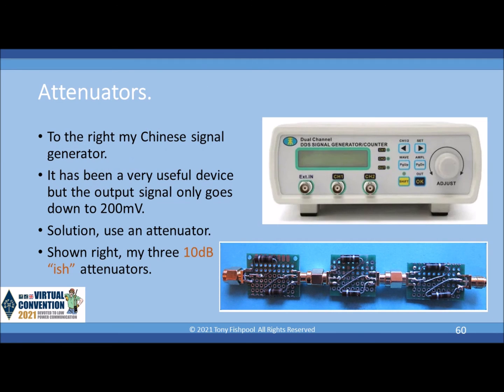So a note about digital signal generators. A few years ago a good friend had recently bought one for himself, and as he's done before, he put temptation my way by letting me play with it. The user interface was a bit odd. They've got a lot better recently, but it produces two unique outputs at any frequency up to 25 MHz, and sine and square and triangular waves, and at any phase difference from each other. It's rock steady, and I've also used it as a temporary VFO. So I bought one, and now I have two signal generators. Oh, and it's also a frequency counter.